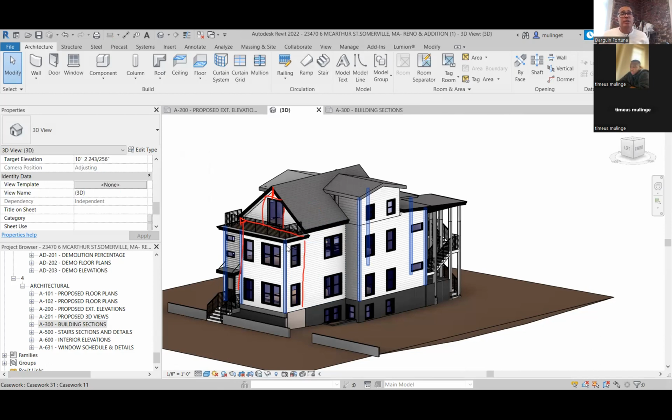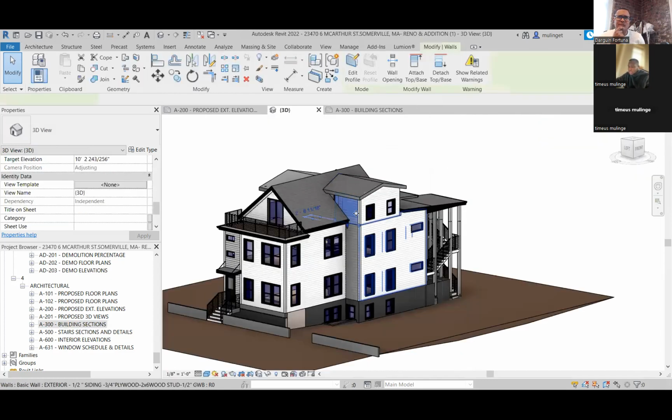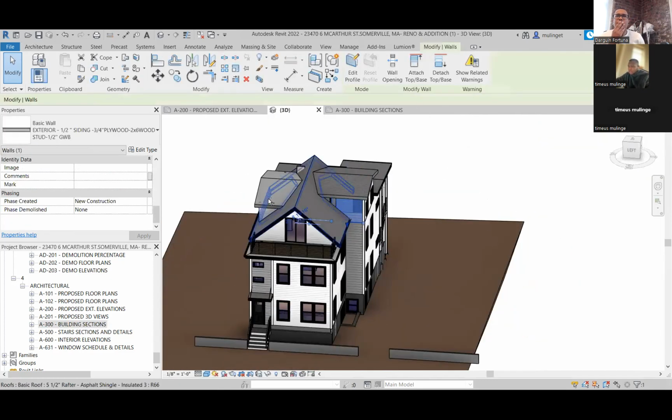So now you need to size a beam that will have 2 point loads. Depending on how big the opening is, are you opening the whole thing? I am opening the whole thing, but the intention was for it to come into this partition wall that separates the units from the circulation space. My biggest issue with this was loading this. Number one, it was a question of the ridge beam on an existing roof that you're adding a dormer on both sides to.